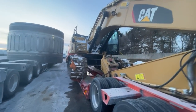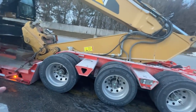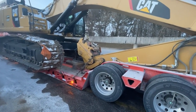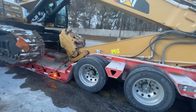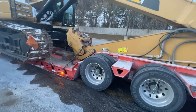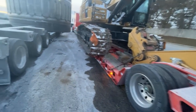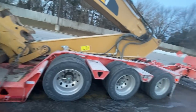I was going to switch to all mechanical evener beams but I'm talking myself out of it. We're going to order two more trailers almost identical to this one — same neck, 30-foot nine-wide drop side rail, 24-inch tall main beams, 15-inch tall deck, two-plus-two hydraulic. We won't run it with a Jeep; we're going to run it as a true eight-axle rig.